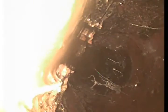It looks like we are still on the clay tile pipe. Here in a sec we should be. Come and see, there's another seam right there. It doesn't look as good. There's definitely roots growing on the side walls of the line, and it's looking like the bottom of the line is almost trenched out, meaning that there's a hole going all the way through where this water is running, but it's not. I think it's just because of the amount of debris that's getting caught up in this line from the roots and from earlier on in the pipe, which is going to be just about right here.